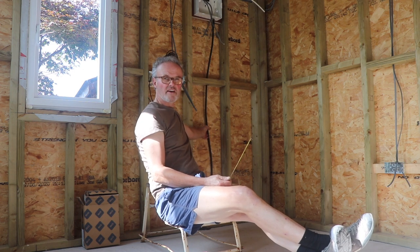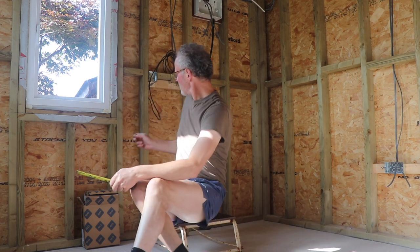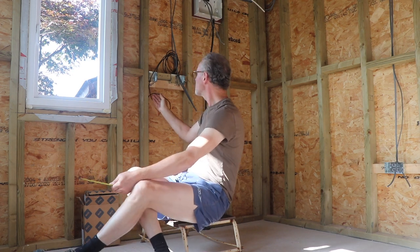You can see the armoured cable coming in here up to a junction box and consumer unit, and from there the electricians fitted the wiring for some downlighters and a series of sockets around the room. You'll also see over here I've got a Cat5e cable — basically that's going to give me a direct link to my router in the house so that eventually I'll be able to get internet in the garden room as well.